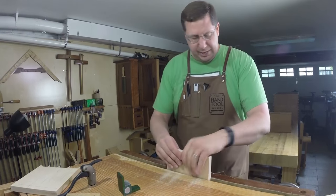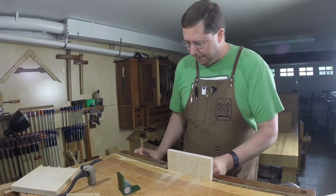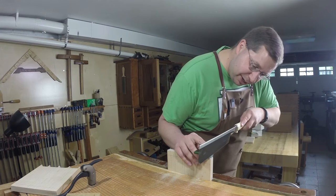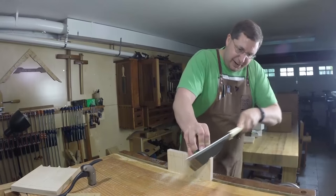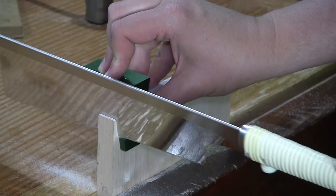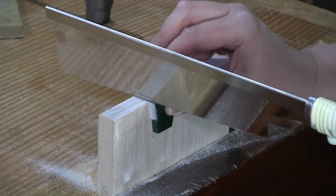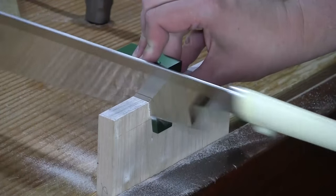Here's another thing that's a little weird for me: you have to flip the board around to do the other angle. Immediately, from the way I'm used to doing things, I'm rebelling at this because it's just another step. But now that I'm flipped around, I can saw the same way, the same angle, the same process — but now I'm sawing the opposite side of the tail. There is something to be said about the consistency of your body position, despite the weird mechanics. A lot of times when you're sawing dovetails, you'll have one side — one angle — that you're really accurate with, and the other angle is a little bit weird. This way, at least we're locked into the same angle the whole time.